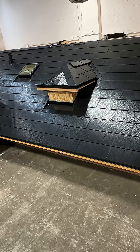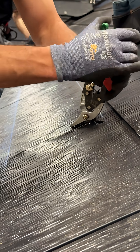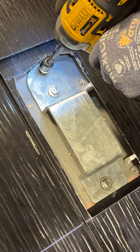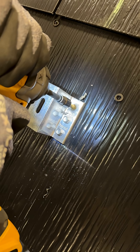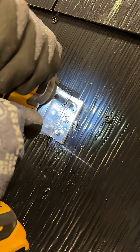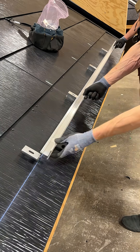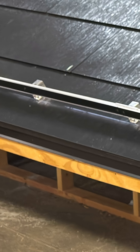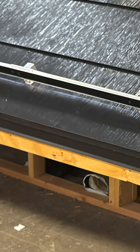When tile has already been installed, a hole needs to be cut into the metal tile that allows the accessory bracket to sit on the decking and be secured into a rafter. The snow fence and brackets will then fasten through a tile skin and into the accessory bracket. Accessory brackets and snow fences cannot be attached to PV nor glass tiles.